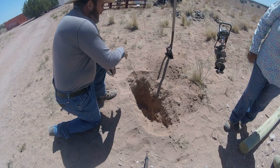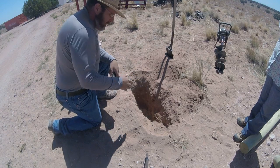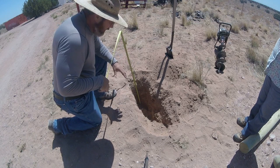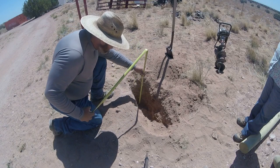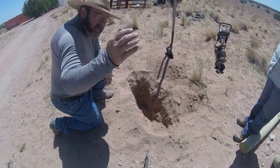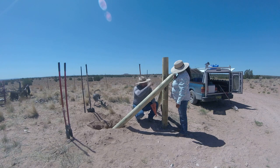We dug our trench. I just took the auger and punched a series of holes from five feet to three feet back towards our main gate post. What we try to get — it's not always the case depending on the contour of the land or obstructions in the ground — we try to get 22 inches of depth. That way, when the post is on a 45-degree angle, we end up with about 30 inches of post in the ground. The next thing we're going to do is set the post, mark it, and then cut our angle on the brace post. We're looking for a 45-degree angle, and that's about what we got. We're going to mark this post, cut it, and put it in position and attach it to our main gate post.